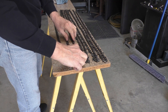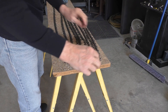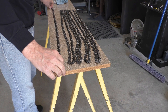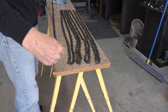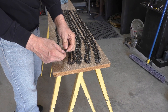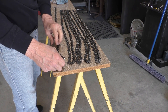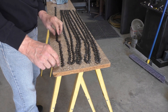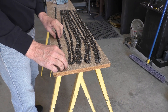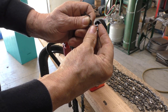Out of my 25 foot piece of chain, I've cut out 91 drive link chains, and I also have this leftover piece that's about three feet long. You want to keep that piece because you can cut butterfly links out of it — on each side of a tooth, if you leave the drive link on it, you can use those for repairing a tooth section. Maybe you hit a rock or piece of metal and can take a whole section out and replace a bad spot in your chain, so it's still a pretty useful piece of material.